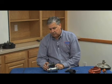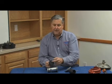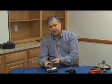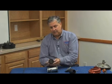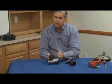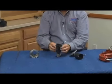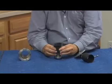The other one I want to talk about was the trip ratio, and we talked the trip ratio is the effective area of the elastic element. In this case, we have a rolling diaphragm versus the disc, kind of pretty close to almost about 1.5 to 1, isn't it? Much different than we saw in the fabricated steel design. So we have a lower trip ratio. Then we also have a rolling diaphragm. In this case, we have an extremely sharp folded rolling diaphragm.